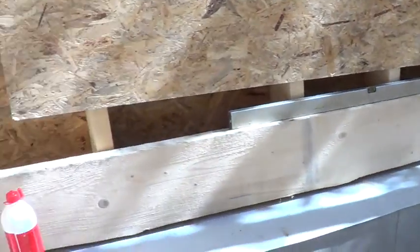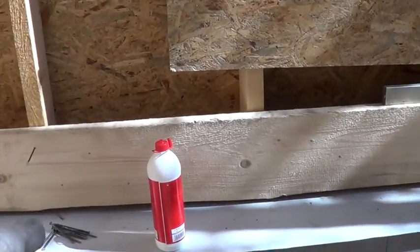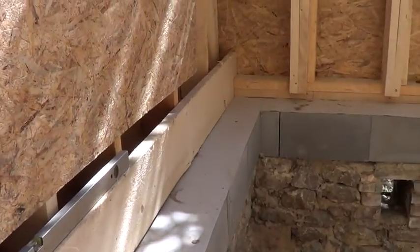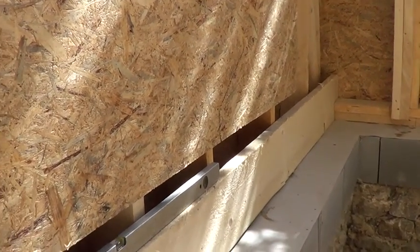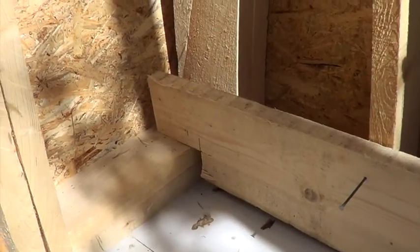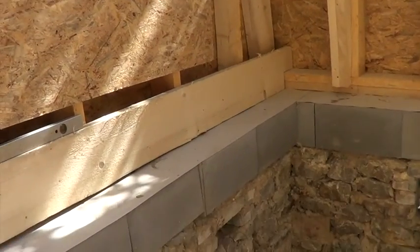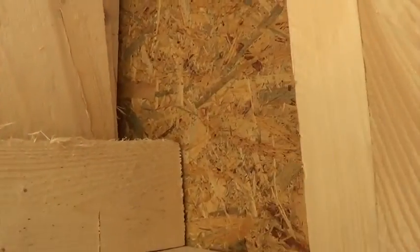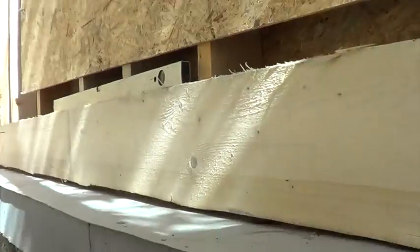It's the first of the wall plates. This particular piece is not wonderful because it's at the edge of a tree, so it's a perfect place to nail to the wall. But because it's a floorboard and the wood is not completely dry yet, there would be some shrinkage. In order to optimize the chances of this wood not creaking when stepped on, we're going to be gluing wherever it meets any other wood — a little bit of glue and the nails.